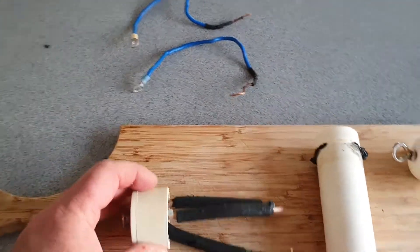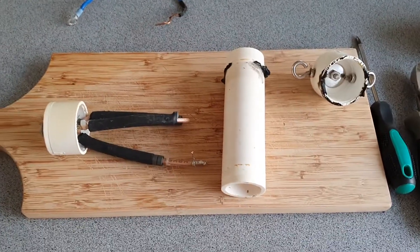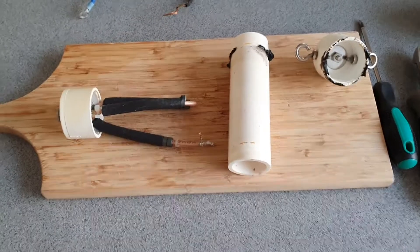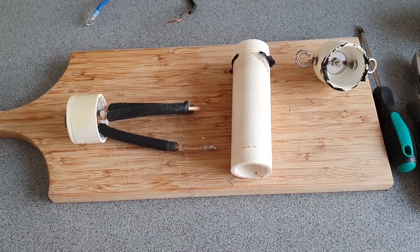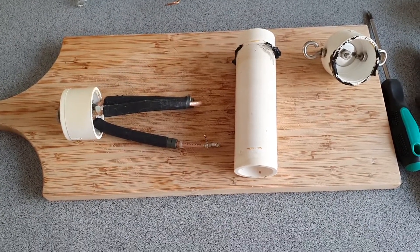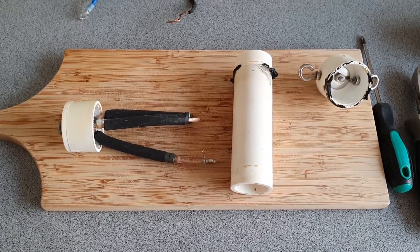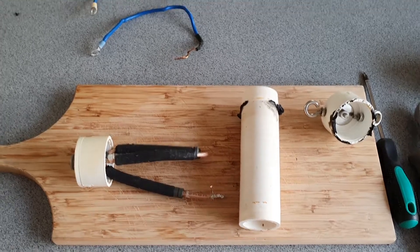Well, that's clearly not what High Gain, the antenna manufacturer, advises that they want you to use. They want you to use a transformer match in order to give the right matching to the radio. Their particular units are the BN86 and the BN4000, which is the three-kilowatt version of that.